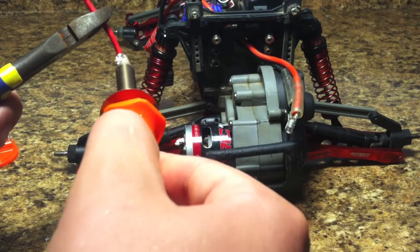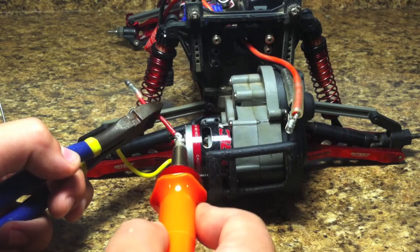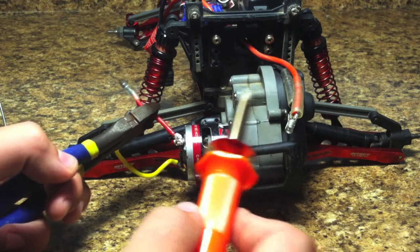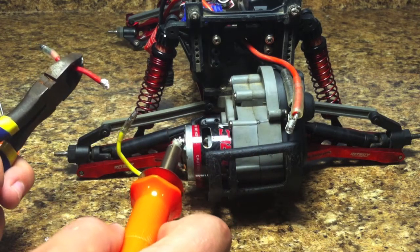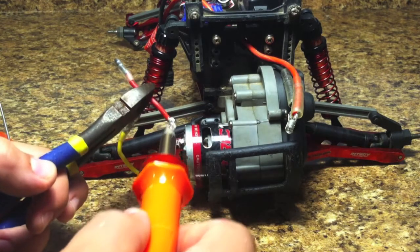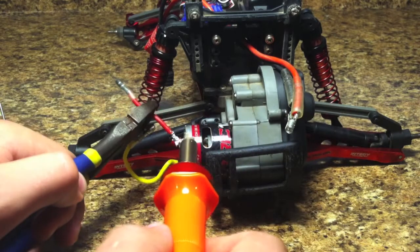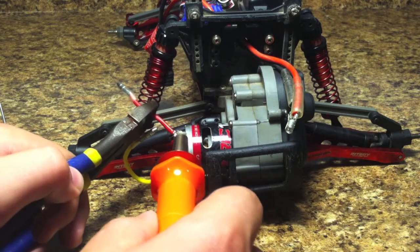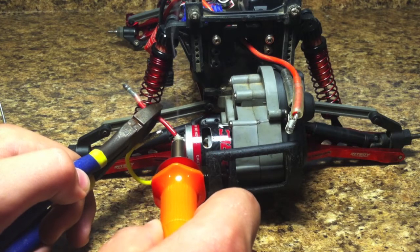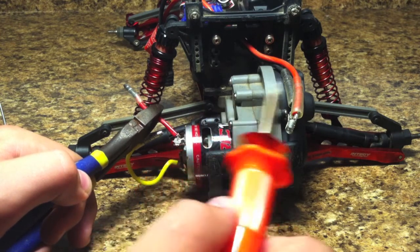As you can see it's still not quite biting yet. Let's get a little bit more on there. I think what we're doing here is I've got a little bit too much solder on the terminal itself, so I'm going to take a little bit of the solder off — like that — and then let's just put it right back on. I think the first time I overdid it just a little bit. Pretty cool.